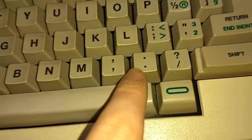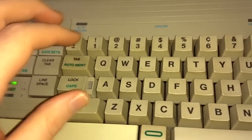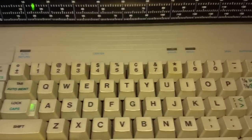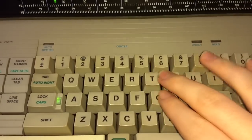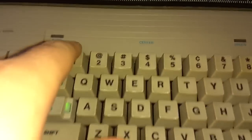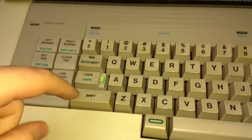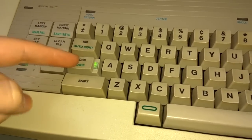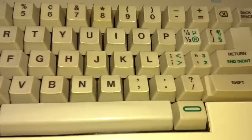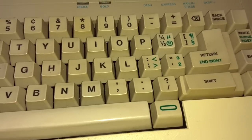Other special characters — the comma and period: the shifted versions are also just a comma and a period. That makes sense because when you turn on caps lock by pressing this key, it is a true caps lock for all the keys. On a computer keyboard, caps lock shifts the letters permanently but won't shift the numbers or punctuation. But on this it does — with caps lock on, if you press the numbers, you get the shifted symbols. And to turn caps lock off, like a normal mechanical typewriter, you don't hit it again — you have to hit shift and it turns off. That's why the comma and period are replicated for the shift, so when caps lock is on you can still get them as needed.